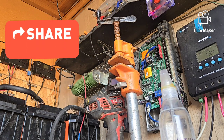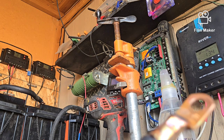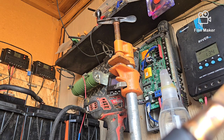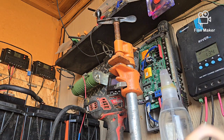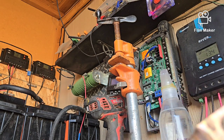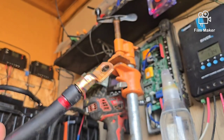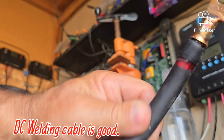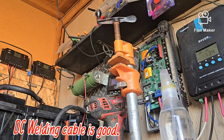That's about it everybody — that's how you solder end lugs onto copper wire. This is 1/0 wire — that's one-diagonal-slash-zero — and you usually use welding cable, which has a fine copper mesh inside. You don't want coarse wire on this; you want it soft and flexible so it moves. Thank you for joining me everybody, this is G Bear signing off.